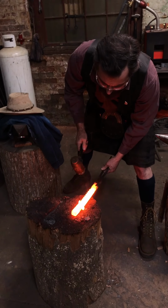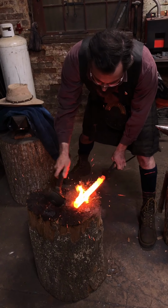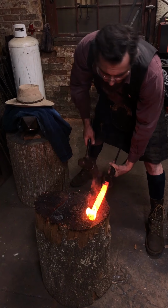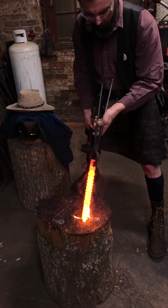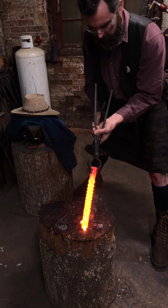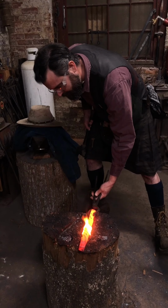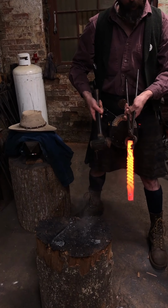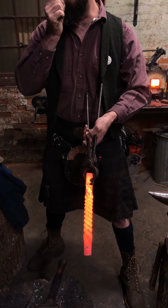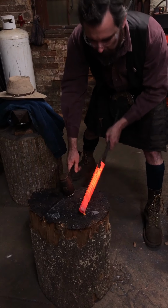Treat it always as square material. As soon as you start trying to chase a form, it gets tricky. So instead, just make your life easier and go, okay, this is a square bar. I strike it only on the square planes. And you'll probably find far easier results. That was pretty easy there today for straightening. They don't usually go that smoothly. Always look, excuse me, always look from both ends. Your different view of things helps you see errors.